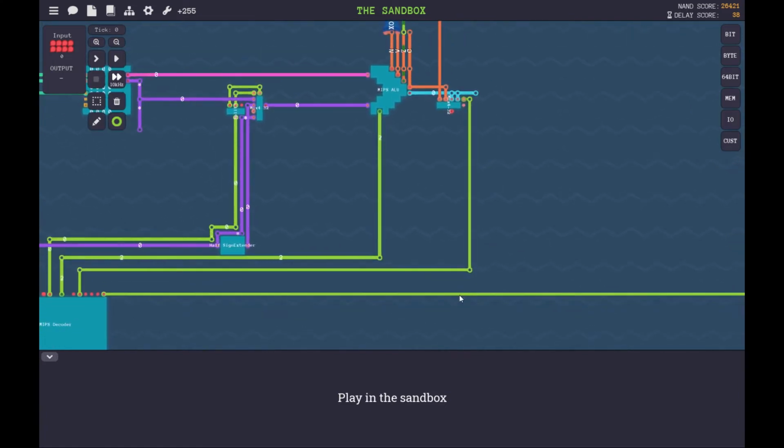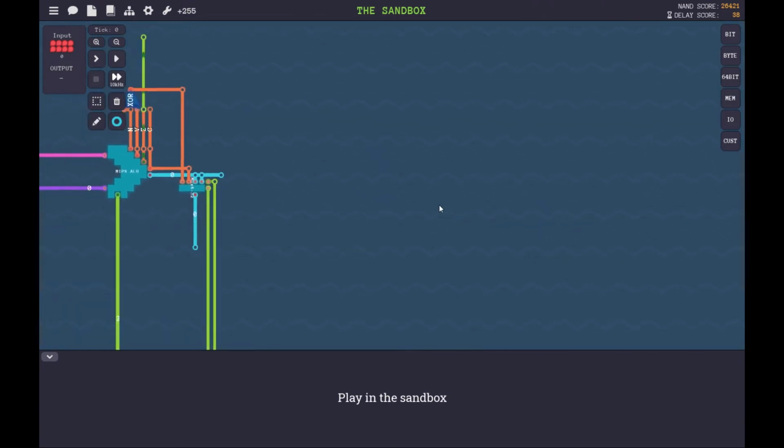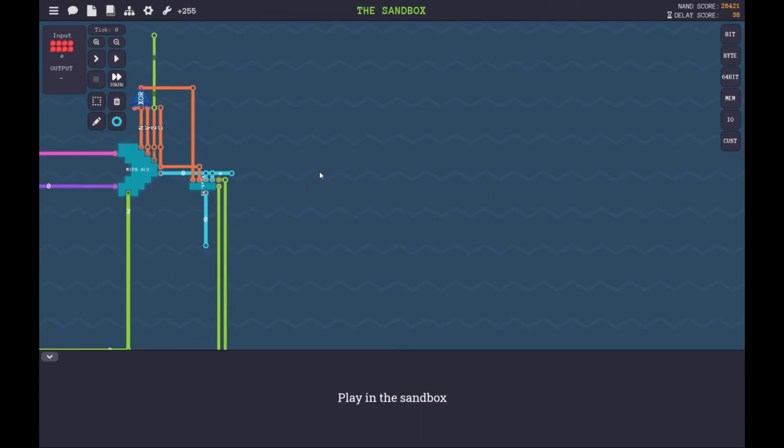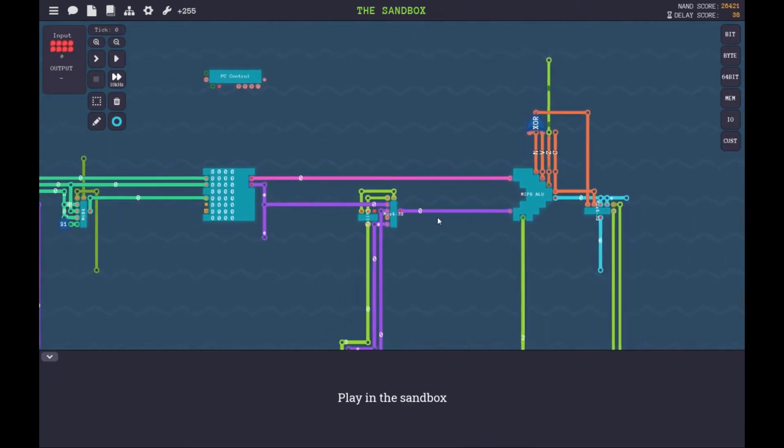And the other one is the signed bit, which tells us which one of those two outputs we should use. And so now we have our ALU result. But this isn't always the result of the instruction, right? Some of the instructions have memory accesses as part of what they do. And so for those instructions, we need to talk about the addressing mode, which is base plus offset.